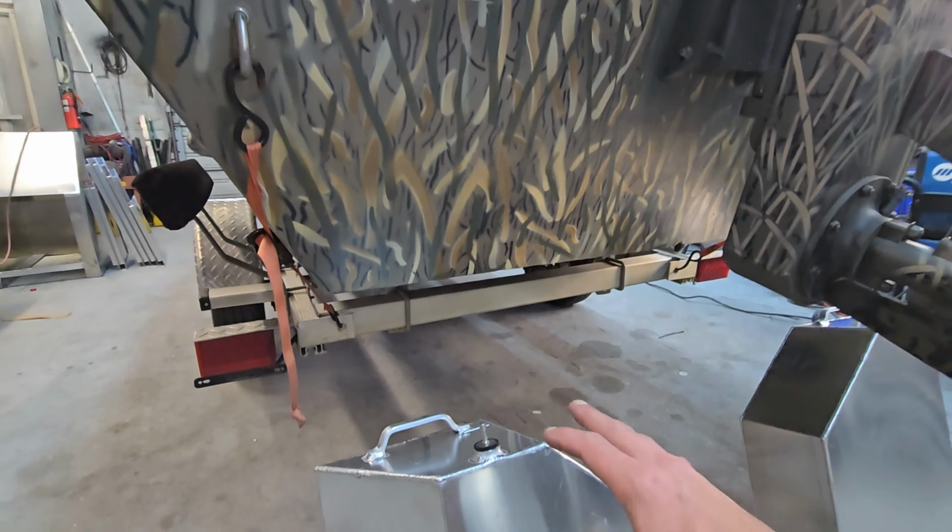We're gonna see how these pods do because you might not need to move those batteries once we put these pods on here, but I've got a feeling even with these pods on the back of this transom, those batteries probably need to go up front unless he's gonna upgrade to some lithiums, because those are just standard batteries and they're pretty heavy. It's probably got 160 pounds of batteries right there. So it would definitely probably help him out because up front he has no weight, none whatsoever. I mean, he's got this little Riptide up here. This thing doesn't weigh anything. I mean, you're talking maybe 40, 50 pounds max.